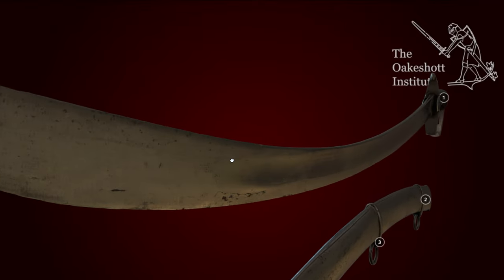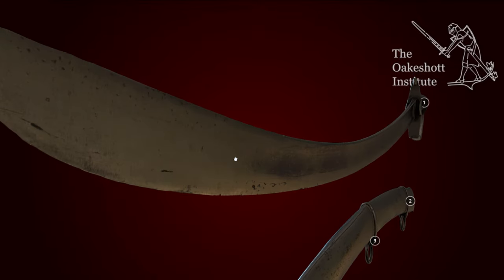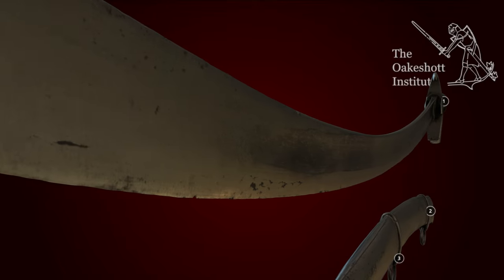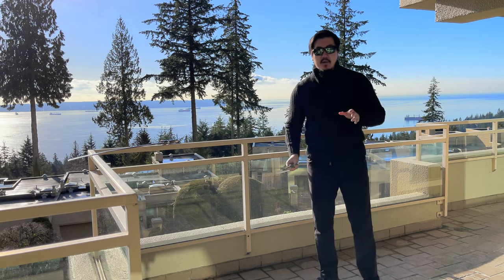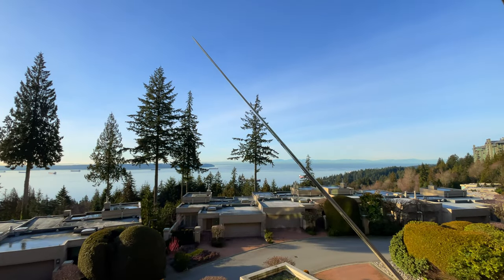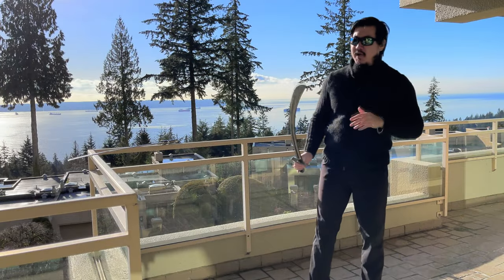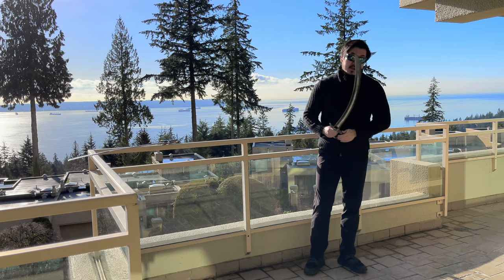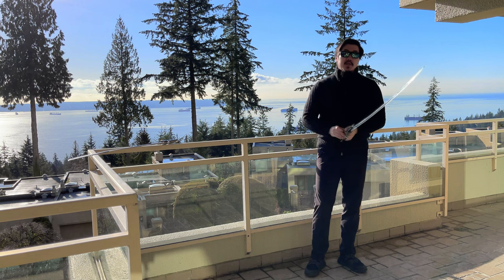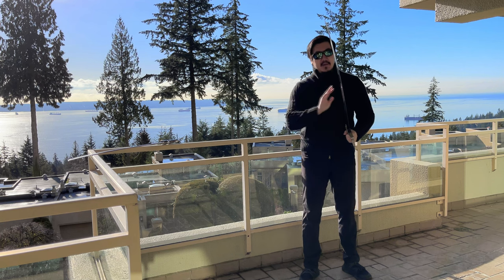And you can see on this 3D scanned model of the Pattern 1796 by the Oakeshott Institute, based on an antique, the upper portion is somewhat convex, kind of like a lenticular cross-section. And we do know that these 3D scanners are quite high resolution, so this is rather accurate. Whereas the Windlass version is rather flat on the upper portion. There's not a very noticeable lenticular cross-section. So I hope this can be improved. Of course, I'm going to do some additional sharpening to fix this, but